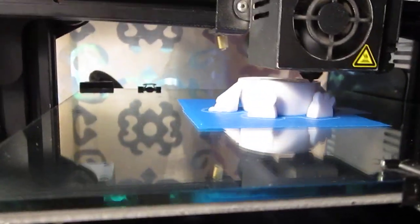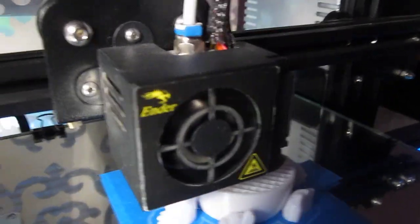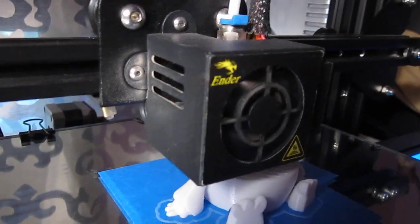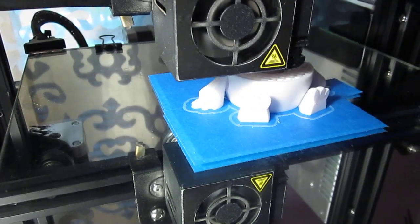And again, we're going to take a little tour of the print. There's my springs. They're stock little silver springs, not the yellow springs or the silicone chunks of rubber that some users seem to think they need. Maybe they do, I don't know. But I just use what came with the printer, and there's proof right there. Also, what just came with the printer is this hot end, as it came out of the box. Nothing fancy, just standard, run-of-the-mill. No electronic gizmo here. Just not needed because I use the paper feeler gauge. I've mastered the technique. I know how it's done, and I just level my bed using that.